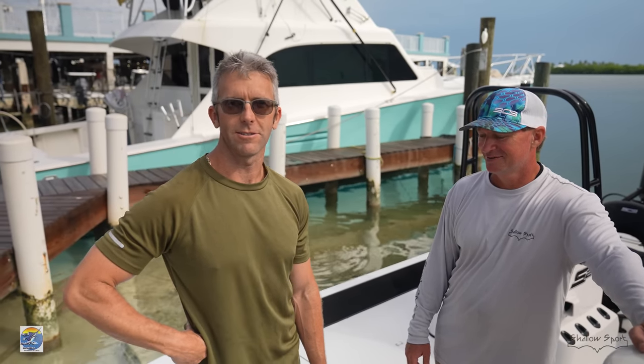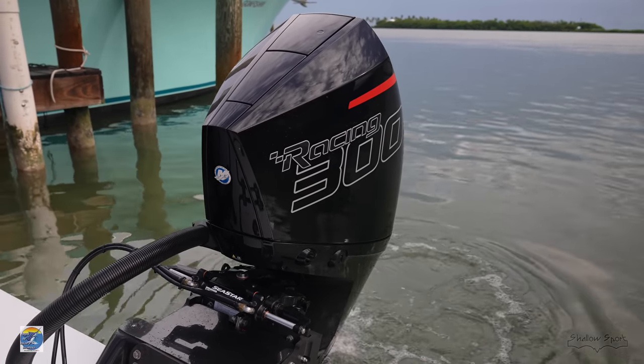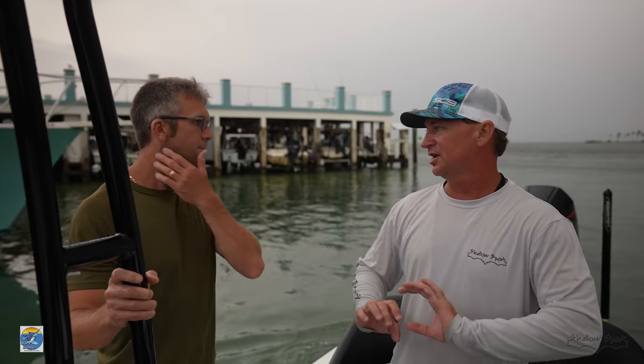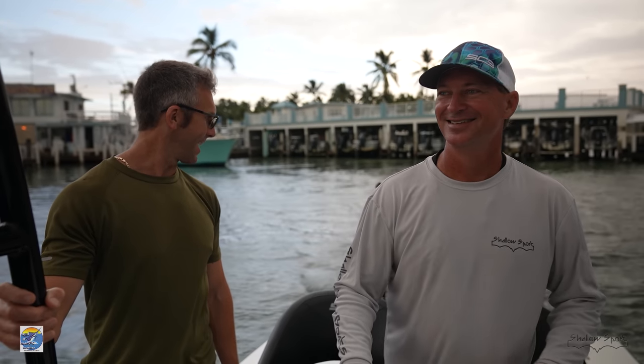It sounds a lot different than stuff we're used to — let's go take a ride and see what it can do. I'll trim up when I'm in the marina or in and out of reverse so the prop thrust goes under the boat instead of into the tunnel, giving more control. Wide open throttle, we're getting between 2.5 and 3 miles per gallon. Wow, full speed wide open — and you can run over pretty shallow water too with the tunnel and air going under there.